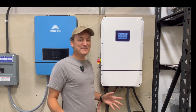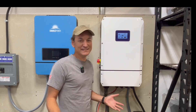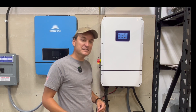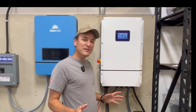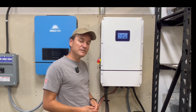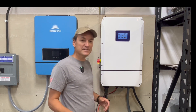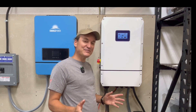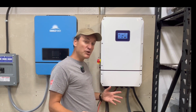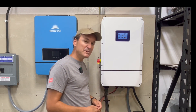I had a lot of different messages, emails, and comments asking me to do another video on the inverter. A lot of the questions were just how do you like the inverter, how well has it been working for you? So one of the plans here, aside from what I'm going to show you in the video, is just to keep cycling this inverter. There's a lot of people interested in this inverter because of the price point. It's a hybrid inverter, so it can interact with the grid — you can feed back to the grid or do zero export. It has a pretty small form factor for a 10,000 watt inverter. If you haven't seen the previous video, it might be good to check that out.